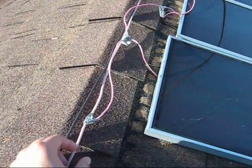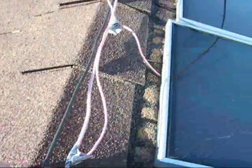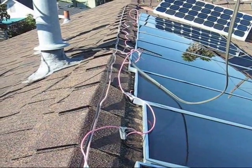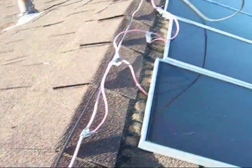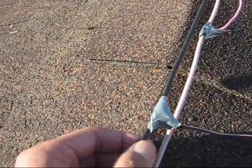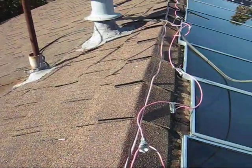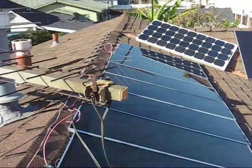To create something in parallel, connect the red — the positive with the positive — for every single solar panel. Also, do the same for the black connections, the negative. Connect all the negative connections together. Do this for every single solar panel.